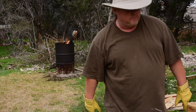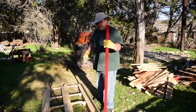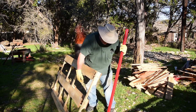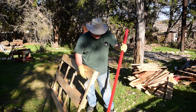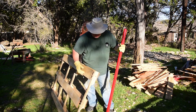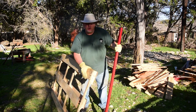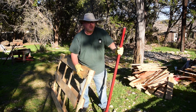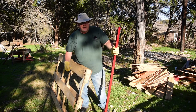From there, it's just rinse and repeat — work through the stack and end up with a whole bunch of boards with nails sticking out. One thing I've discovered about using a pallet buster: if you have a pallet with really large cutouts where the tool goes in, don't waste your time — I'm just smashing those up because it takes so much more labor. Also, cutting the outsides first and then prying up the insides is the right order. If you start with the insides, it all goes wrong.